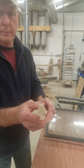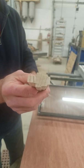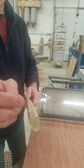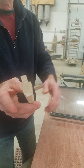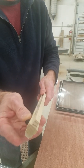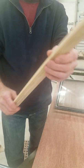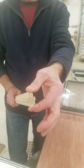This is your typical muntin — probably what you have in your house. This is the divider, and these are the shoulders on which the glass rests. On yours, this may be three-eighths like this one is, or it may be a quarter of an inch. This is about seven-eighths of an inch, and that represents the OG profile that makes your windows look so nice. This can be made out of any material, but typically it is one and three-eighths thick, just like your sash.